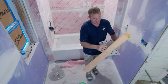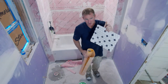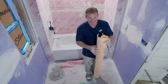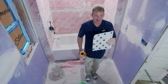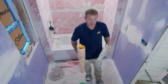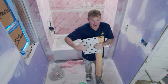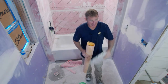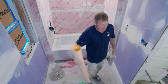So you would have a seam, an overlap. It doesn't seem like a big deal, but it is a big deal with smaller mosaic tiles like this. Any hump or bump is going to make it raise in an area, and you're going to be able to see that. This is very difficult to overcome. You can add additional thinset underneath, absolutely, but you're fighting the thinset in between the tiles and getting it out of there. If you could get your floor 100% flat, then you don't have much to worry about. So membranes were kind of out for me.